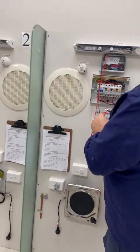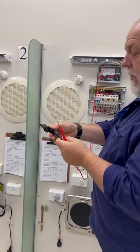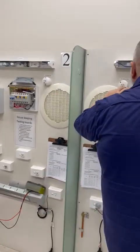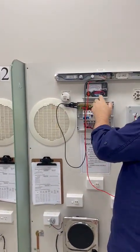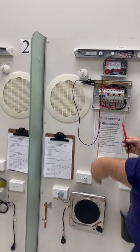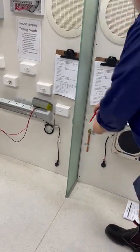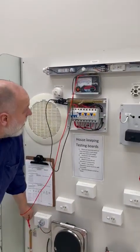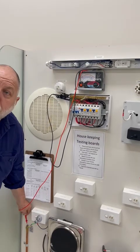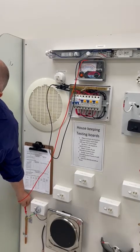I've done that — it's reading zero, happy with that. I'm leaving it on three ohms. I'll swap to the clamp at the other end and put that on the main earth. I don't need to disconnect the MEN at the moment because we're not doing insulation testing — we're just checking continuity of earth. I'll come down and put it on the earth stake. It's coming up at more than half an ohm — on the three-ohm scale it's reading close to two and a half — that's definitely a fail.